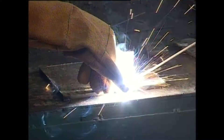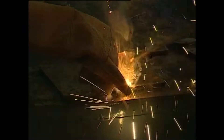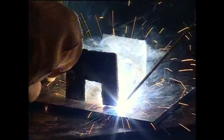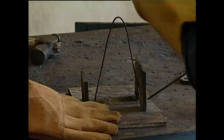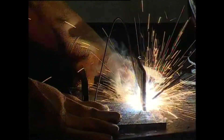The C-clamps are used for tack welding the test piece in position. The root gap is ensured by filler wire of appropriate size. The test specimen is then tack welded to the test table.